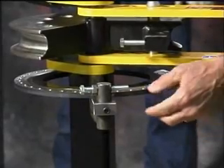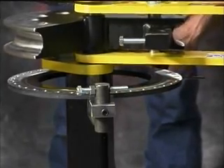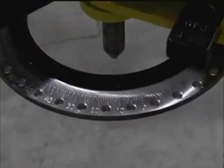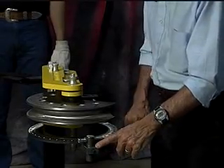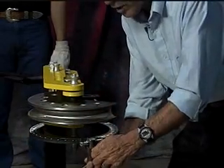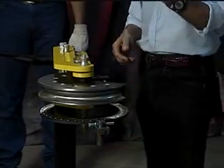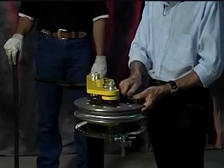The degree ring is an extremely rigid unit — three-eighths of an inch thick steel. It bolts between the bender and the stand, has been machined to be perfectly flat, and is engraved in degrees. The unit has an adjustable stop for setting repeat bends. It unbolts and can be repositioned anywhere along the ring. It's telescoping so you can drop it out of the way, and it has a fine adjustment. A pointer assembly fits onto the die with a small tab on top to tighten it.